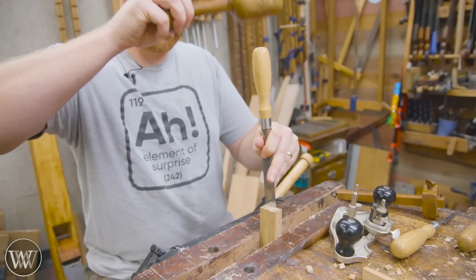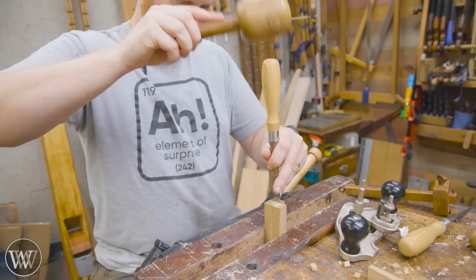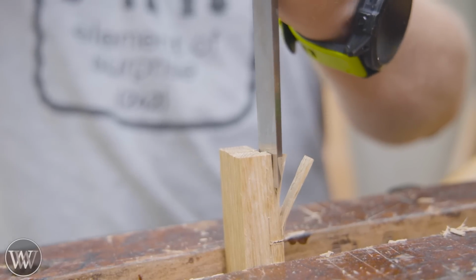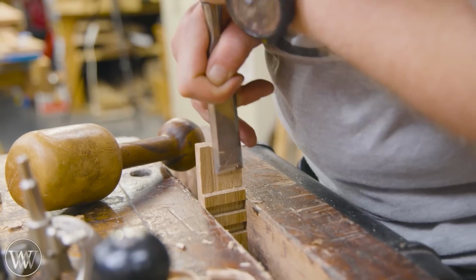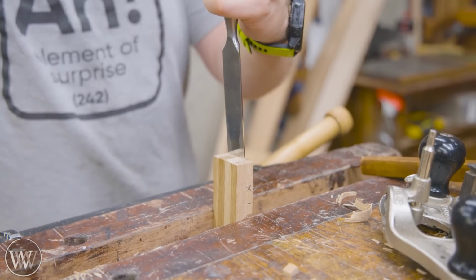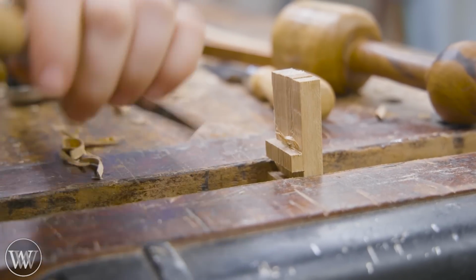On the ends of these, we're going to cut off a 1/4 inch so that we have a 1/2 inch tab sticking out. And this 1/2 inch tab is what's actually going to be sitting on the floor on either side. So this will get rabbited into, or not rabbited, but dadoed into the frame all the way around. I'm going to just mark it off with the marking gauge and then come in and pare things out. I could come in with a saw and cut these down, but with a thin stock, I usually prefer to come in with the chisel and pop it out.